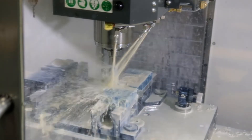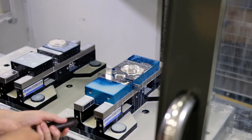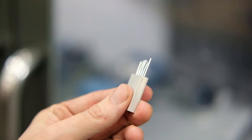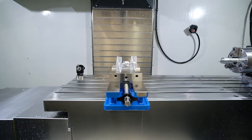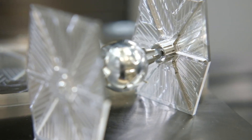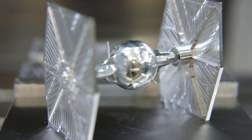I took it over to the drill press and pre-drilled those holes for the body, and then I machined the antenna as well as the laser cannon to be inserted in there. I did a CNC program in Mastercam to mill those out of a scrap piece of aluminum, and then just filed them down and inserted them right in. I really enjoyed this project.